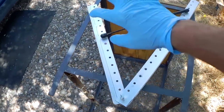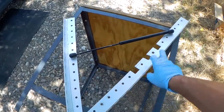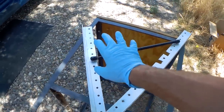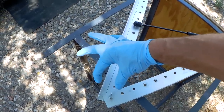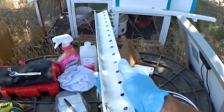The first step is figuring out how I'm going to cut these brackets. This is currently what it looks like in its full glory. These notches were cut to allow this piece to come down into here, and I had to reverse it — I had to cut another notch. I need to cut these holes out and make these brackets shorter in both directions so that when I close this and put it on the roof, it's not sticking up three or four inches. I can't use these tilt brackets if they stick up that high — it's just going to catch too much air on the freeway.